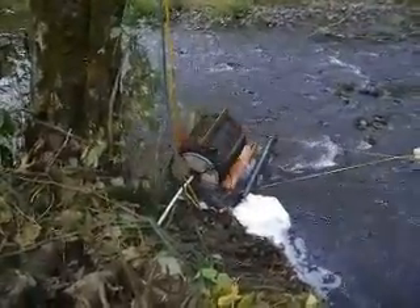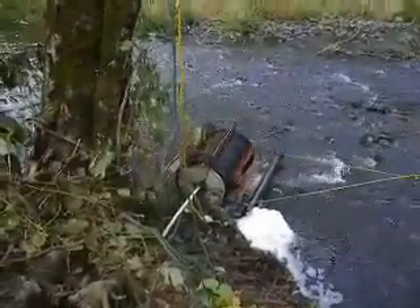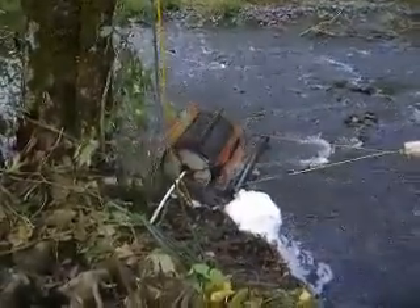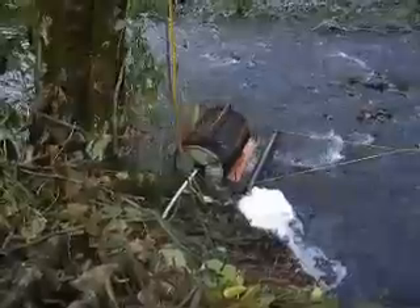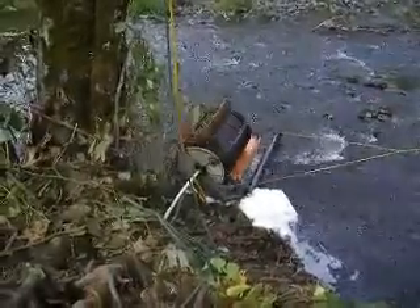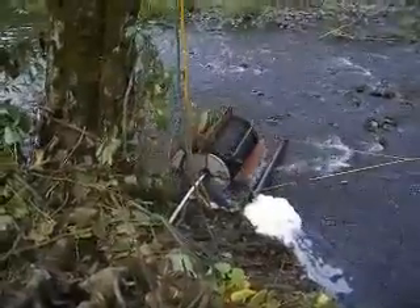The boards are relatively cheap — just tied on with wire and string. If something comes along and breaks them, they're cheap to replace. At this rate, it is able to lift water around forty-five feet efficiently at about three gallons per minute, which is pretty good considering the energy utilized is equivalent to a person riding a bicycle at ten miles an hour on flat ground.